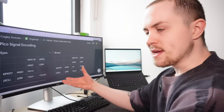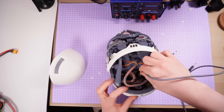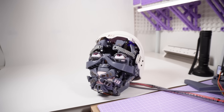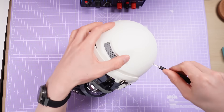I'll figure that out at a later date. Using Python and a serial connection, I developed a quick GUI application to test all this functionality from a single control panel, using the mouth Pico as the master which instructs the eye board and the eyebrow board — a little different from my initial plan, but working pretty well for now. To polish off the skull I added a fan to keep all the electronics cool and some panels to keep it secure.